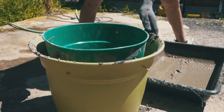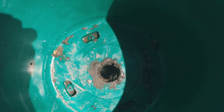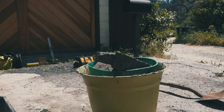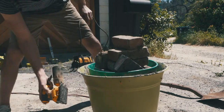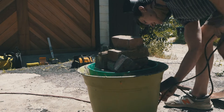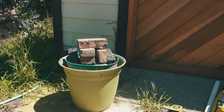You're going to want to make sure you don't add too much water at the end because you can't dilute it back with concrete mix. The concrete was pushing up the bottom but the PVC pipe was still in place. Fortunately I had some bricks to add weight and push it down — I stacked as many bricks as I could to force the inner bowl down. To avoid bubbles in your concrete, use an orbital sander — that's the most effective way. If you don't have one, you can use a mallet or hammer to try and pop those bubbles.